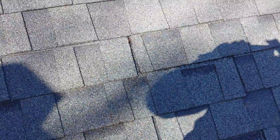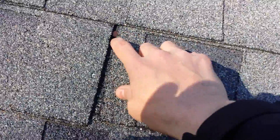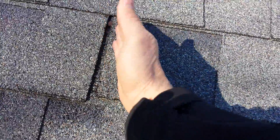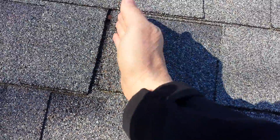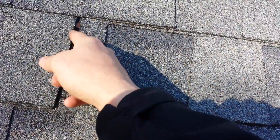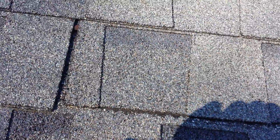Right here there's just a nail exposed. The nail should be at least six inches underneath the edge of the shingles — they shouldn't be anywhere near the cracks here. You've got the shingle and I can see wood straight down in there underneath the shingle.